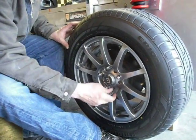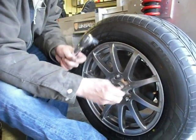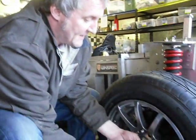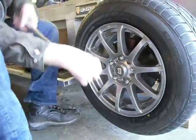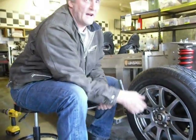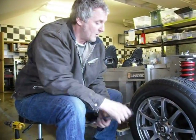Here's the part I wanted to show you. Now that they're getting pretty tight, the natural thing a person might do would be to go ahead in a circular pattern — start here, get this one nice and super tight, then go to the next one nice and super tight, and continue around counterclockwise. What you can see that could happen there is you can end up with half the bolts as tight as could be, but the other half aren't tight at all. From there you can get warpage and cracking when you're bolting things together.